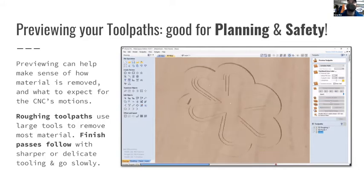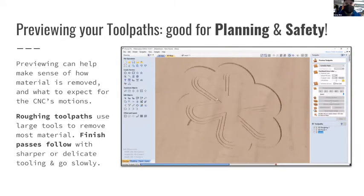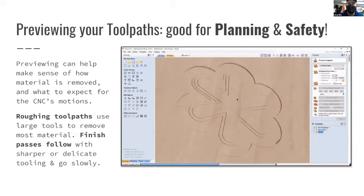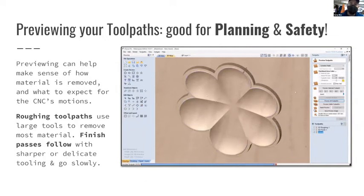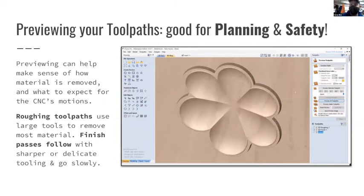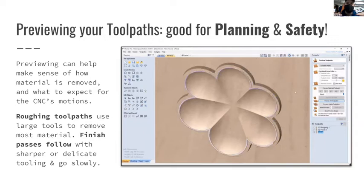For full three-dimensional machining, the Gerber and Tormach are great. The Shapeoko can do it but don't push it too hard on precision 3D work. Regarding two-and-a-half D versus three-axis CNC: three-dimensional CNC means you can move in X, Y, and Z - all three axes. The Shapeoko's Z-axis is underpowered, so it's more often considered a two-and-a-half dimensional device, though you can give it commands in all three dimensions.